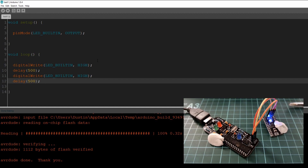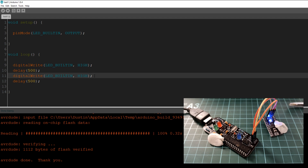Well, this didn't go as planned. I wrote a simple sketch to blink an LED, and to save time I copied one line, but forgot to change the second digitalWrite from HIGH to LOW. So it was HIGH, 500ms delay, HIGH again, looping forever — meaning the LED was constantly on. I changed line 11 to LOW and now we have a blinking ATtiny3217, blinking once a second.